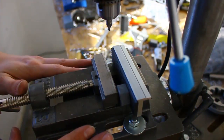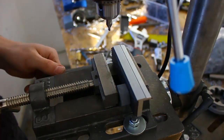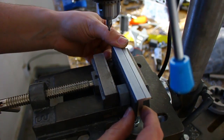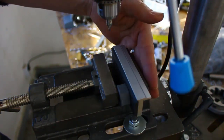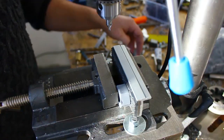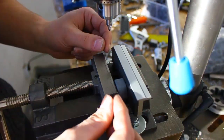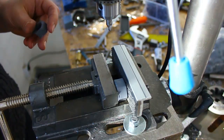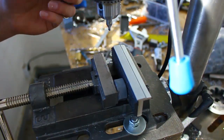I've locked down the vise to the drill bed. I have a soft jaw — an extremely soft jaw. This is actually rubber on an aluminum backing which rests on the unmoving jaw. And I have a nut for spacing because when I tried to lock it in it wanted to pull itself sideways, since it's not exactly the best kind of vise available. In the chuck I have a center point drill, or a stub drill depending on how you call it.